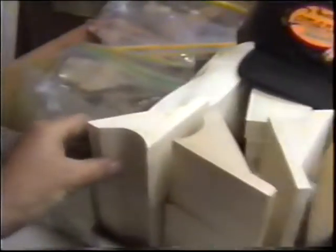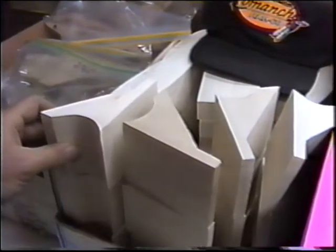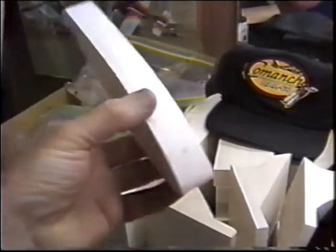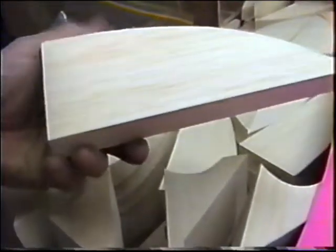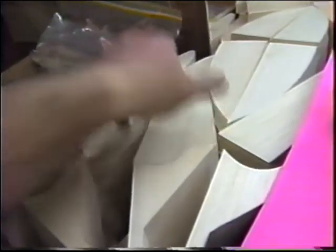Now, when I cut out the cowlings, you can see here's a piece we dedicated for cowlings right here, how they all lay out. Once they're all cut out and sanded, they're ready to carve. Or, of course, if you want to go for the option, you can go for the fiberglass option. This batch of wood came out with some nice one-inch pieces. I used the harder ones for wheel pants, the softer ones for inboard wingtips. And when you have a whole pile of wingtips, you want to put the lighter ones on the inboard tip so you can maximize the use of the good wood.